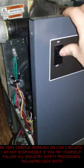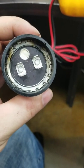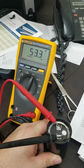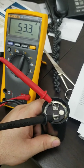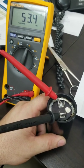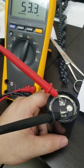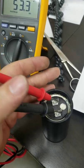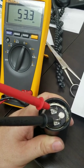I've already kicked the power back on and we're gonna hit the on switch. So the capacitor is actually still good — it is fine. We had made a resistor bank to try to get a bleed resistor in there on short notice, but the resistor bank could not handle the wattage going through it, so it toasted the resistors. The capacitor is fine though. We're gonna either have to make a new resistor bank or just order some resistors in — they were way out on lead time, so we tried to make do.